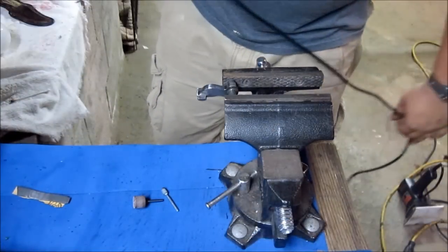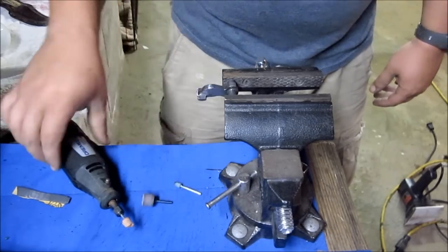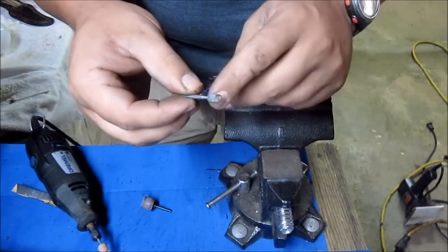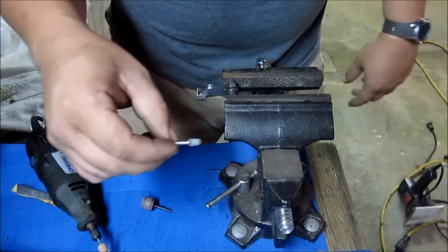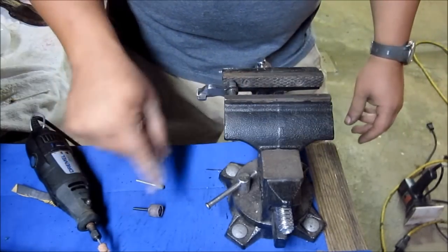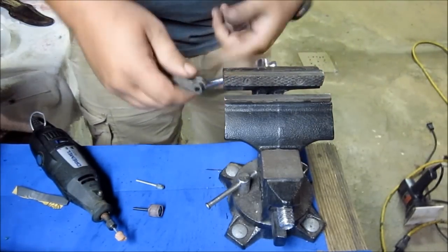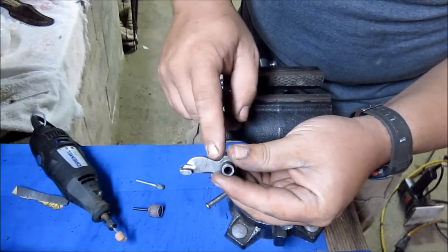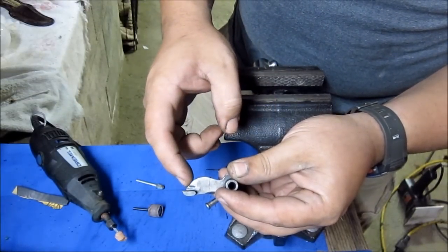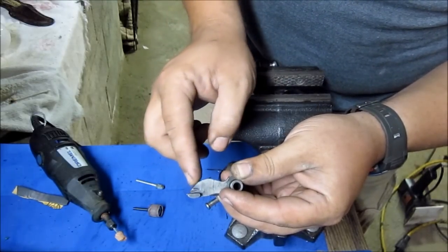We're going to move it over here to the vise. Go ahead and put your hammer in a vise if you've got one. Get your Dremel tool. The bits you're going to want to use: start with the smaller orange grinding stone, follow it up with the green grinding stone — the little small one — then use the fine sanding cylinder, and follow it up with that before going into the polishing stage. What we're going to do is change the angle — on an AK hammer it's coming up very sharp, over sharp down like a block, and you want to change it to where it's kind of circular.